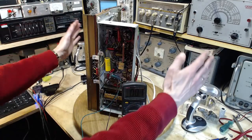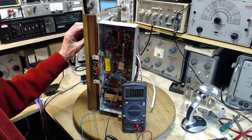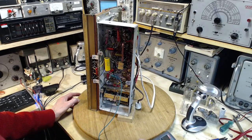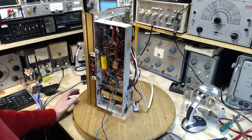Wah! Okay, oh, so sound out of the speaker scared the bejesus out of me. Big whopping hum came out of that speaker. So that implicates a whole pile of filter type capacitors. But it certainly proves the 3V4 theory.